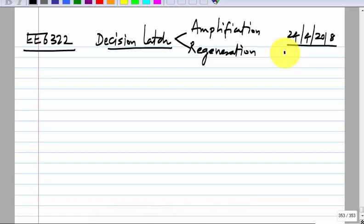There are many architectures for this. Essentially every flip-flop works like this — every flip-flop also has this regeneration mode where most static flip-flops have some positive feedback and then resolve the levels into either 1 or 0.